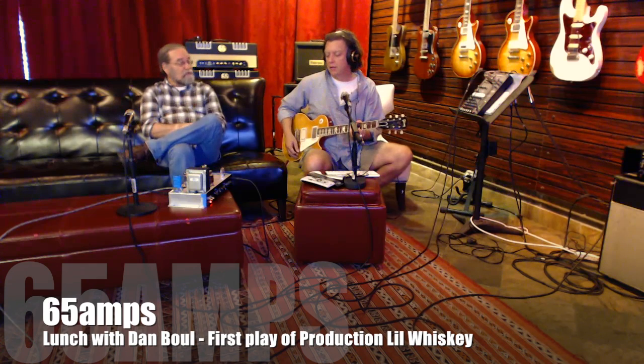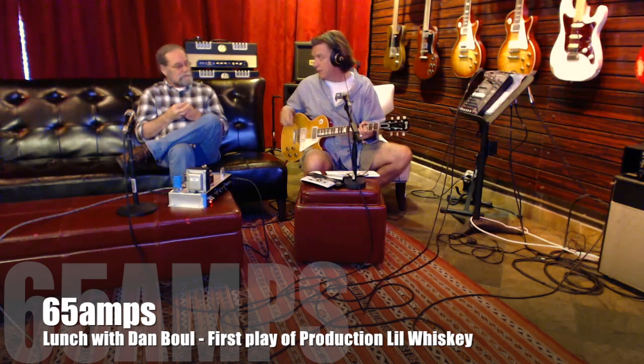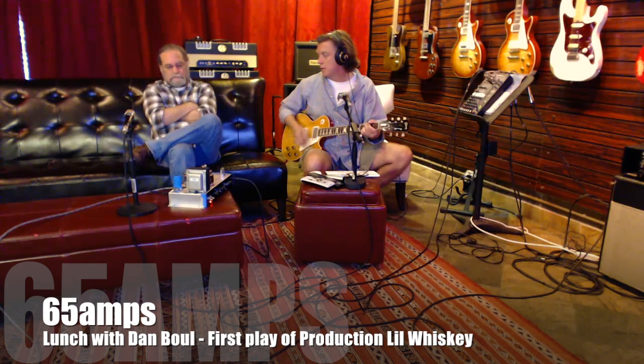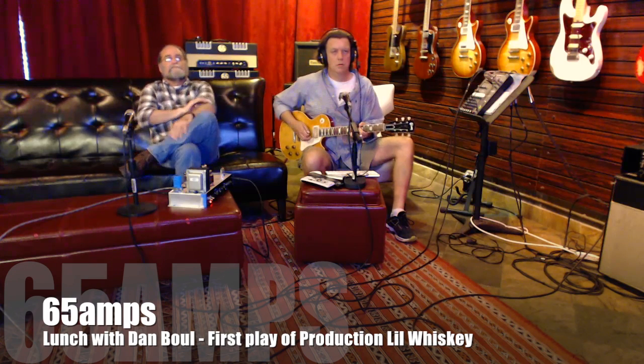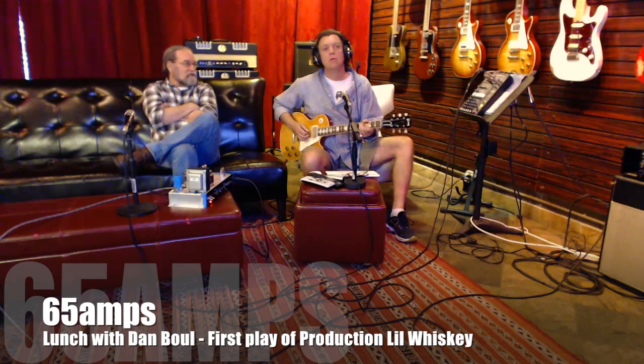It was an amp we built to a price point, not to a tone. Right. So technically right now I could take the big whiskey, put 6V6s in it, and use the other tap on the power transformer, and I have another amp, with a couple of component changes for the biasing and stuff. Grid resistors. How this sounded with 6V6s.